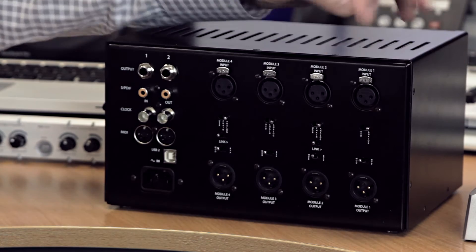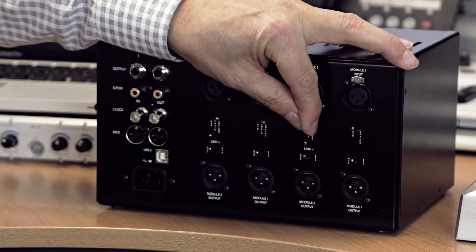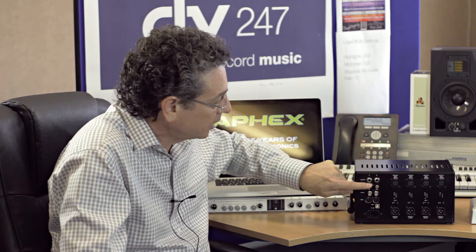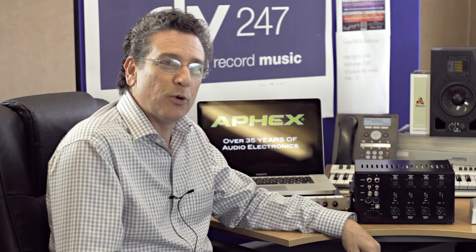In addition to the analog switch, there's a switch you can flip to USB mode. If you had four mic pres, mic pre one goes internally to USB one on your IO, two to two, three to three, four to four. You also have an SPDIF digital IO with an additional two channels, giving you a total of six inputs into your DAW. The analog outputs still remain active even in USB mode — so it's like a split. If you're doing mobile recording, you have a monitoring system where you can have monitoring and recording simultaneously.